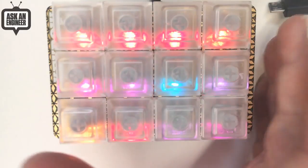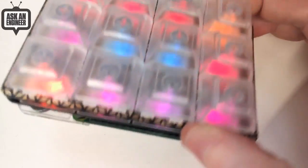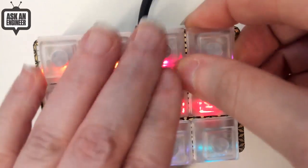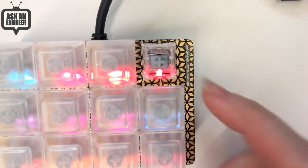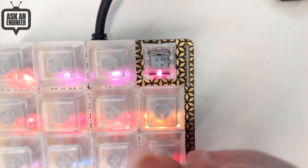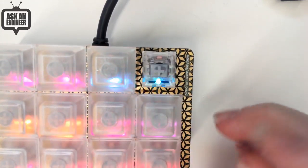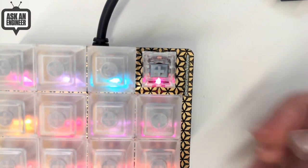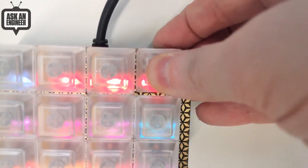It's a bit of a kit but almost complete — you only need an SD card. You put it together with no soldering required. It has really cool clear keycaps, and underneath is a Cherry MX clone switch. They chose that because for this use case you don't need the really expensive key switches — it has the same feeling at a good price. There's also really sweet-looking silkscreen with gold exposed mask. That's the Keybow.